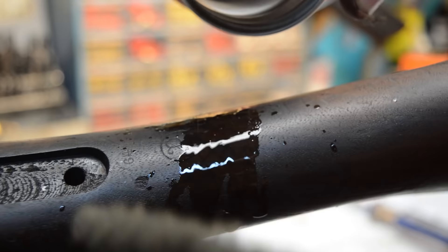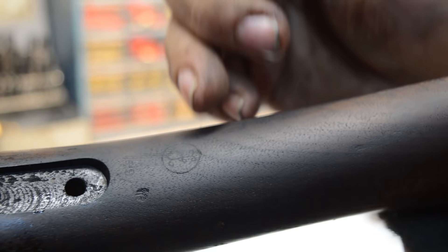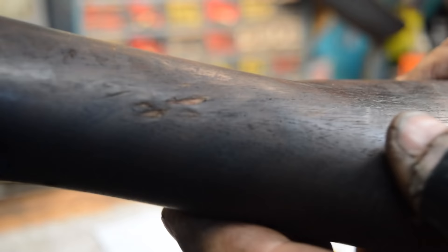Going back to this acceptance mark — it's actually showing up pretty well in normal light. Put a little bit on there and very gently rub through it. We don't want to take the edges off — we want that to be nice and sharp. One of the things you get when things are sanded or buffed is that the front and back edge in the buffer rotation will get washed out — it's called funneling. This whole thing is now turning a nice brown. We're going to pull the dents up and see if we can get these handling dents up with a little bit of steam. Ordinarily steam will craze this finish and turn it white, but since we're buffing the finish off anyway and putting a new coat of oil on, we want to lift some of the more gratuitous dents.